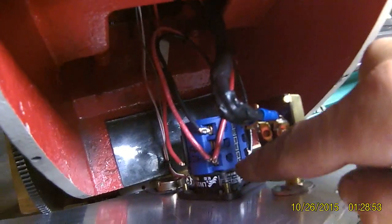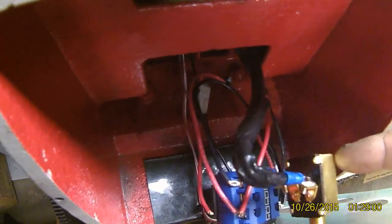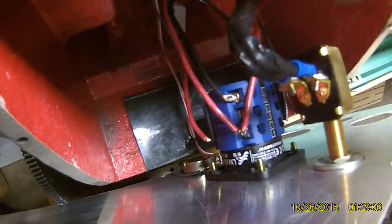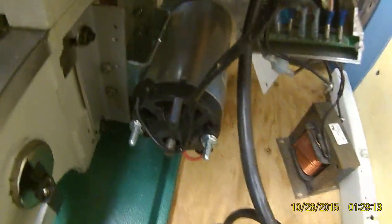If you were to just bring one wire and put it in without crossing, you'd just get forward motion again. So you have to have these two wires crossed over — the positive side comes over to the negative, and the negative side comes over to the positive. That's the switch — there's really not that much to it.